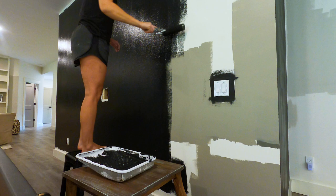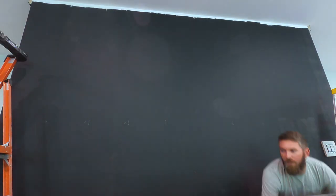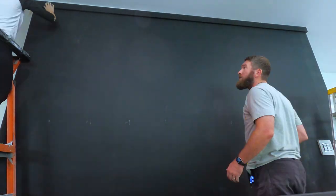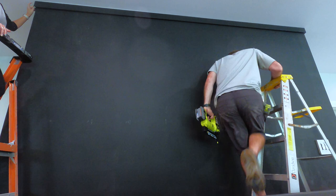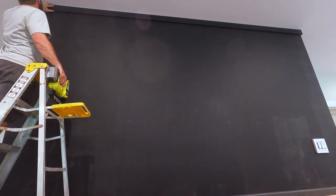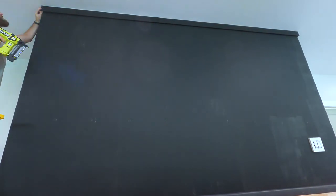To make the painting process a little bit easier, we went ahead and applied the first coat of paint before the battens went up on the wall. To get started, I worked on the top board first, using a pre-primed 1x4. I cut down those boards and mitered the corners for the outsides, then came back and measured for the top board on the front of the wall.